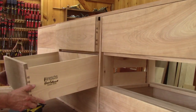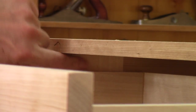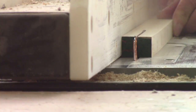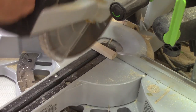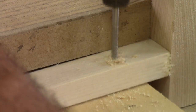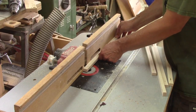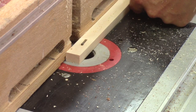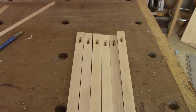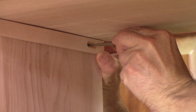But I'm not done yet. The bottom two rows of drawers stay straight when they're open, but not the top one. This is because there's an open space on top of those drawers — I need to add filler strips to solve that. But before screwing them in place, I need to drill some holes. I need to take into consideration wood movement, so at the back, just like for the frames, I drill two holes and cut in between them with the router. Then I chamfer this with a V bit. The other chamfers were much easier to make because I just used a chamfering bit. Now I need to screw this in place. Finally, the drawers are done.